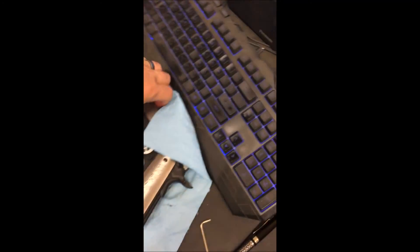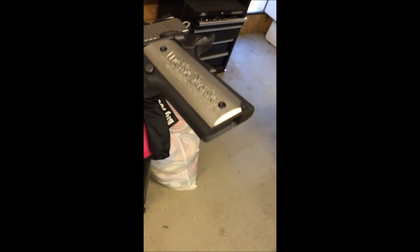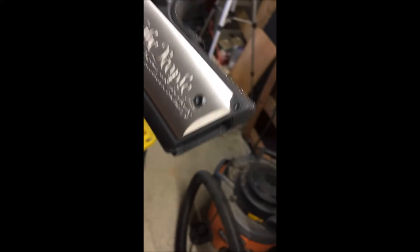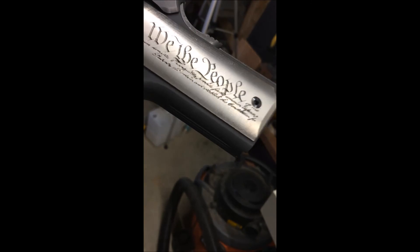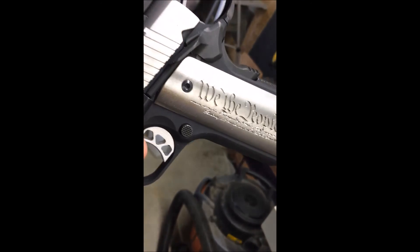And it leaves a nice finish. Check out this finished product here — just a light deburr with a Scotch-Brite, ultra fine Scotch-Brite, and a little bit of 600 sandpaper. You'll see that is a 3% step over on a quarter inch ball with the 6 flutes.